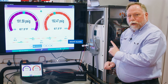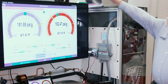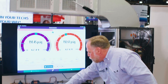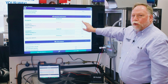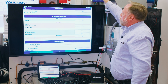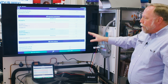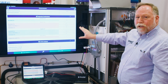Now we're going to turn it on and watch what happens with our pressures. Up top we have temperature sensors reading wet bulb, dry bulb, and relative humidity. Just take the iPad and scroll up — we've got a return air sensor on the return air grill and a supply sensor right on the supply vent. With this information we can actually calculate the CFMs, the capacity, and the efficiency of the unit because we have all this information at our fingertips.